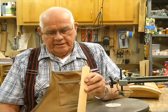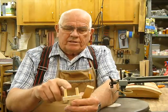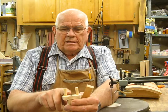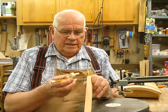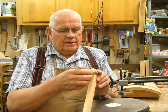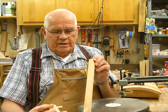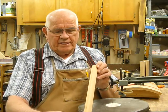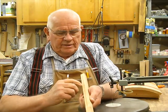So I want to split this in the middle here. What if you put your pencil or nail — whatever you scribe with — in between the two dowels, a sixteenth of an inch off. Most of your blades are an eighth of an inch wide. So then you can draw your line one direction on the board, and then when you turn your little marking device half a turn and go back the other way, it's perfectly centered. There will be two lines.